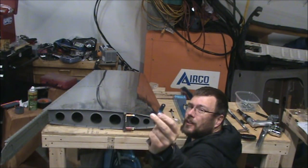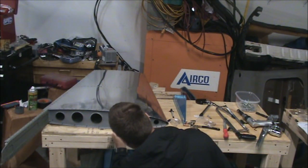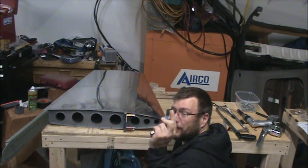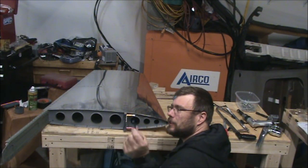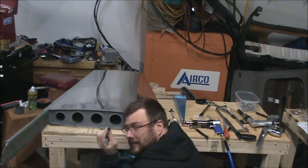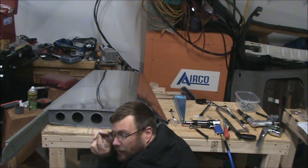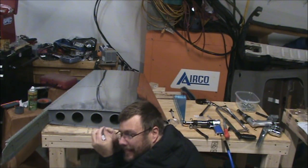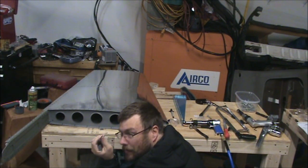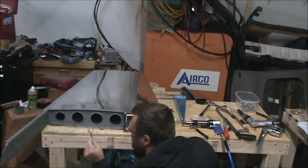So, a note on rivet gauges. I've been talking about how you want the diameter of the shop head to just barely not fit in this hole, while Jason Ellis says that you want it to just barely fit in the hole. What I was researching and found out is there's different types of rivet gauges. Some of them might be the max size that a rivet head can go. On that one, you don't want to go big enough to where it can't fit, otherwise that'll be overdriven. But there's also a min size that you can go, and some rivet gauges are drilled out to that size. So on that one, if it fits in the hole just barely, you're either at min or just below it, so your rivet's underdriven. So you've got to know what kind of gauges you have. It makes a difference.